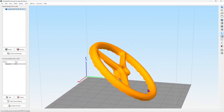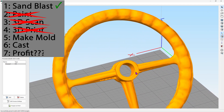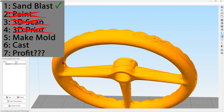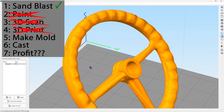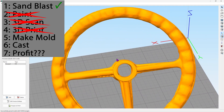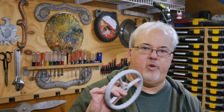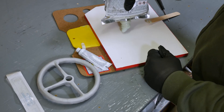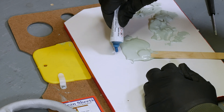I decided I didn't want to spend any more time on scanning and 3D printing, so we're going to skip straight to trying to make a cast from the original. There's a problem with that too because of how this particular part is made — a pattern would really be the ideal way. The sandblasting revealed quite a number of imperfections, so I want to fill those with glazing putty before doing anything else.